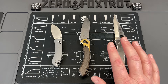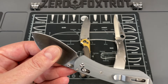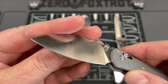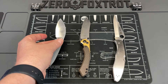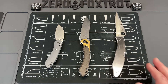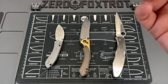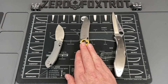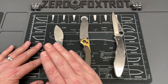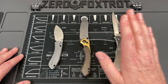I don't have to have something really special and expensive to sharpen these three standard steels — I can sharpen them on aluminum oxide with no problem. You could do that with super steels too, but it's just going to take a very long time and you may want a diamond stone. Some steels like Rex 121 you have to use diamond — you can't use standard stones. And once they get dull it takes forever. With standard steels you can feel them start to get dull. With the higher-end super steels like Maximet and Rex 121, they just go from sharp to dull with no lead-up, and then you've got to pack a lunch to sharpen them.